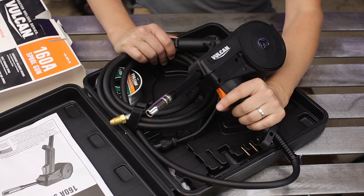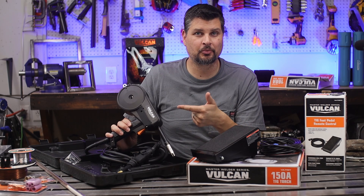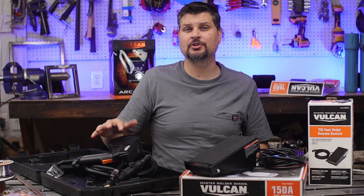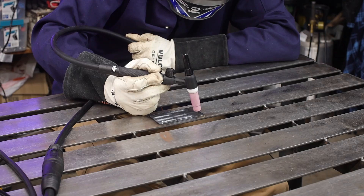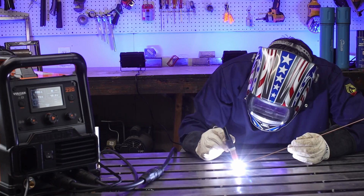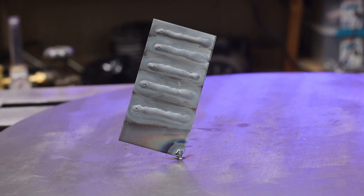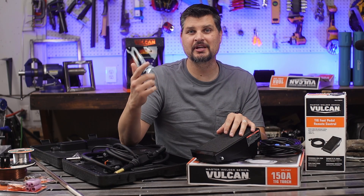Here's the deal with the spool gun: I would say get it if you do the occasional — and I mean just the odd and end, very select few — projects for aluminum. That's what the spool gun is for: aluminum only. And I say occasional because really, if you are going to be doing a bunch of aluminum, you're going to want to step up to an AC type TIG machine. Likewise, for the foot pedal and TIG torch, it's just for that person who wants to dip their toes in TIG welding. The Omni Pro does have a foot pedal, so it's a step up from bare-bones settings, but in reality it's not AC and there's not that many adjustments on the TIG side. These are a couple extra hundred bucks, so I would say forget these and leave the Omni Pro to what it does best, which is your MIG, flux, and stick welding.